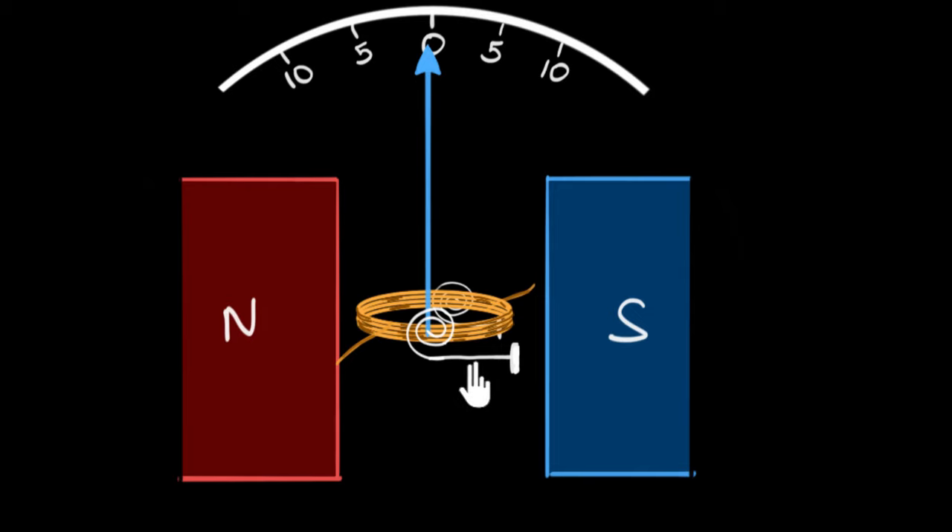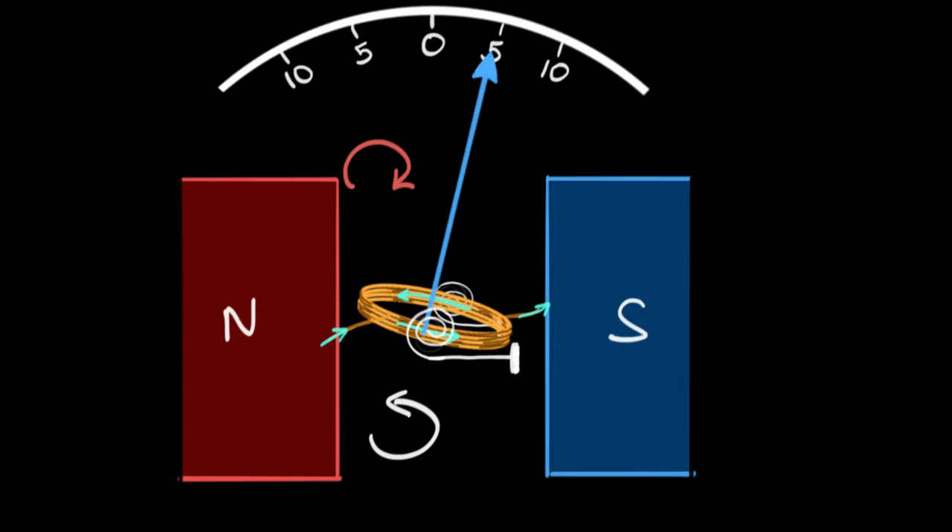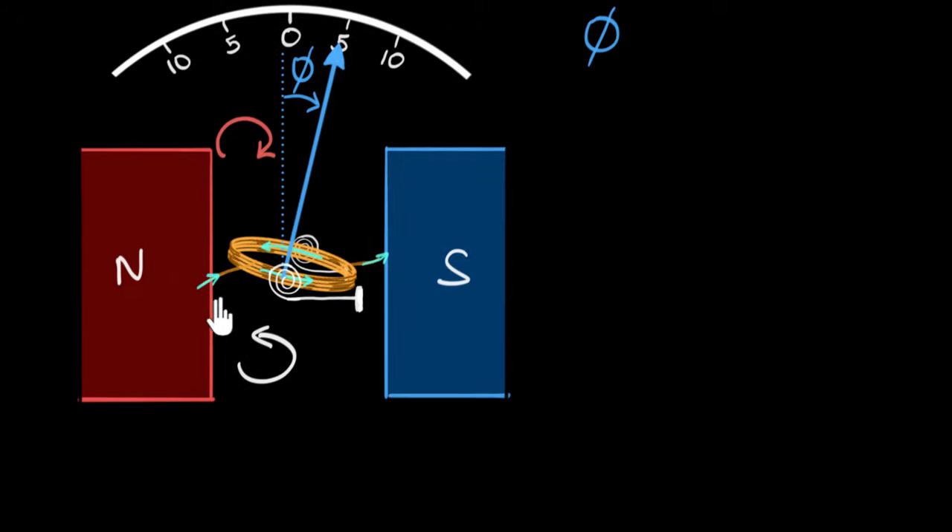We just have to put this together in a box — but not quite yet. There's one last challenge: we need to make sure this is a linear device. We know more current gives more deflection, but we need the deflection to be proportional to the current. If we double the current, the deflection must double. So if the coil comes to equilibrium at an angle phi, mathematically we need phi to be proportional to current I. Otherwise, we don't have a good galvanometer.